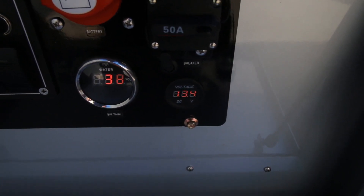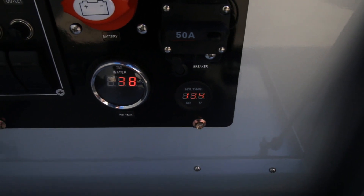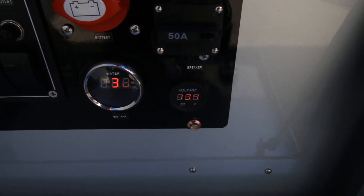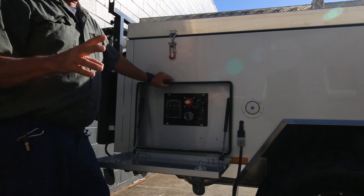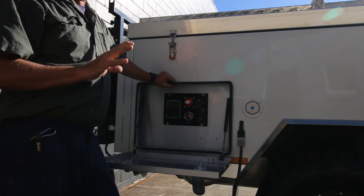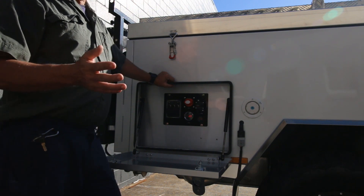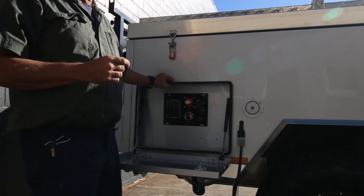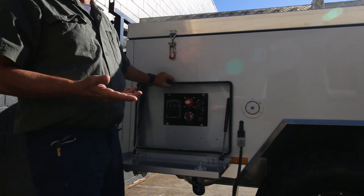It's a nice sunny winter's day. Roughly, you'll get 7 to 8 amps per hour out of a 200 watt panel, and that could increase to 9 or 10 in ideal conditions — but rarely do you get ideal conditions. When calculating how effective your solar panel will be, it's recommended to allow for just five hours of charging per day, because there will be cloud cover, unexpected shadows from trees, buildings, or even your own camper trailer, and your panel won't be facing the sun exactly while you're away.